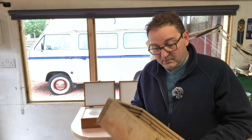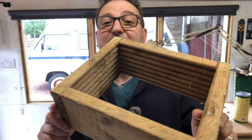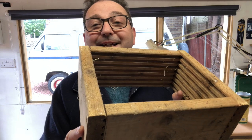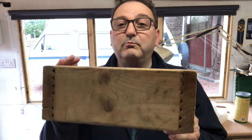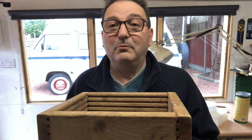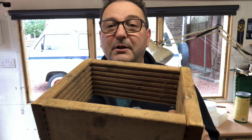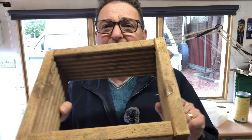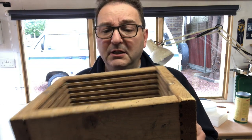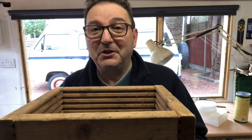I have done a little bit of casting previously and I've still got one of the boxes I used. They don't have to be anything clever - look at this, this is some old decking planks screwed together. I had two of those with some little clamps that bolted them together, but one has since got broken or lost. So I need to make up a new cope and drag. This one is also a little bit big for the sorts of things I'm looking at casting at the moment - it's just a lot of sand and effort for tiny little things.